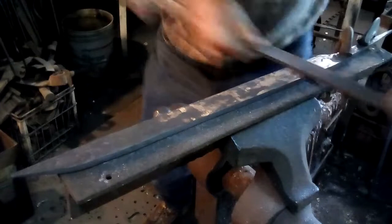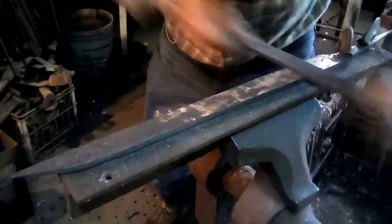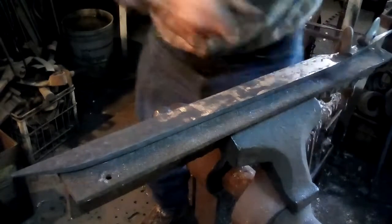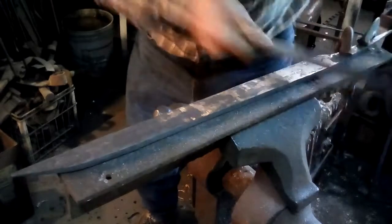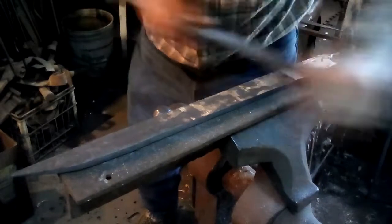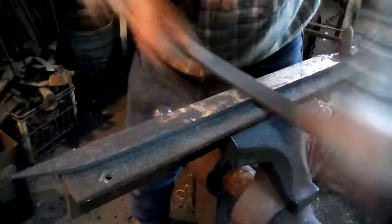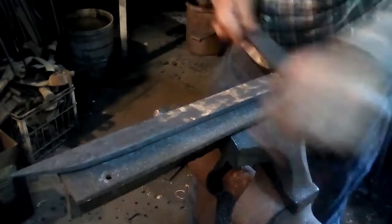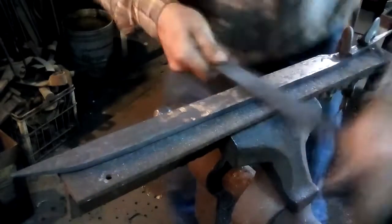Definitely a pronounced grain in the iron. The iron I use for the skin on this seax is welded up out of 7 different pieces, different sizes and shapes and origins, and they're all basically iron, but even iron isn't just iron. There's always other things in there, varying amounts of slag. Some of it has a little phosphorus in it. Some of it has other things in it. There's even a tiny little variation in carbon.